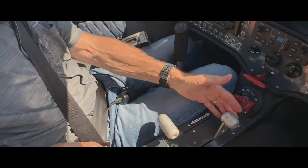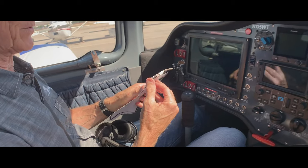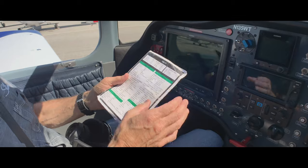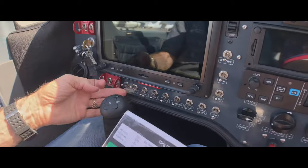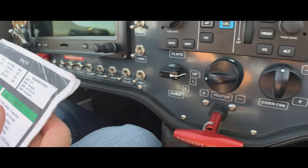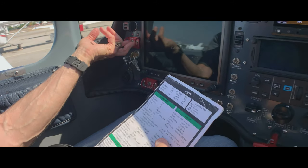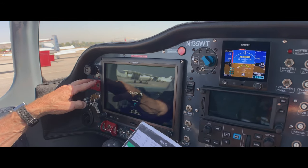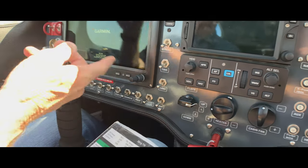So I've got the parking brake set, and we'll go through the checklist for starting the engine. So we've done our pre-flight. So engine start, master on, EFIS backup on, EFIS 1, 2, and 3 on, flaps are up already. Fuel, we're going to select the left tank because it's fuller. Lane A and lane B act like your magneto switches, but in reality, they are the computers for the ignition system, okay? The propeller is electric, so propeller switch on and it's in auto mode.